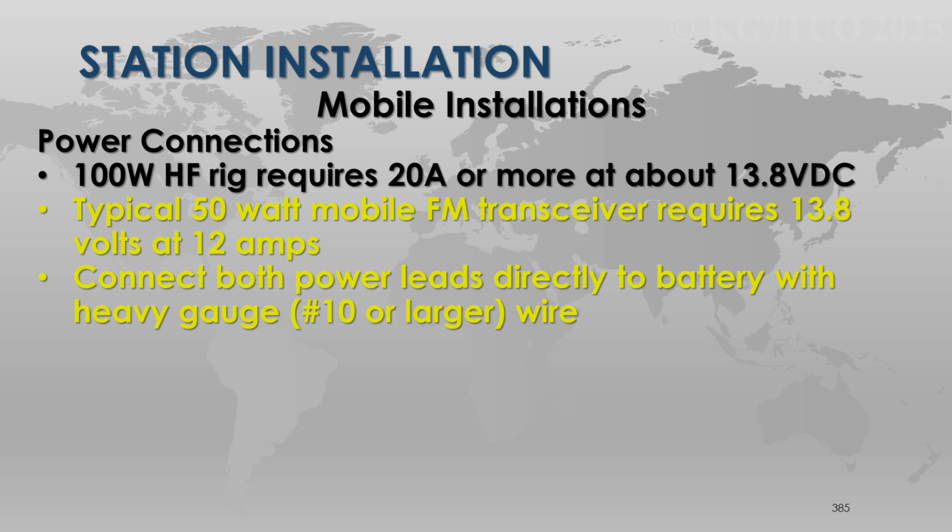They will send you 10 gauge style, and it's just fatter than a 10 AWG wire from Home Depot or an electronics store, but it's all insulation. And it's cheap, junky insulation. Okay? It looks nice and fat, and it's not. And inside is aluminum wire, not copper. There's nothing wrong with copper-clad aluminum. It works, but copper's better. Finely stranded copper. Finely stranded is better than solid or coarsely stranded. It's more flexible.